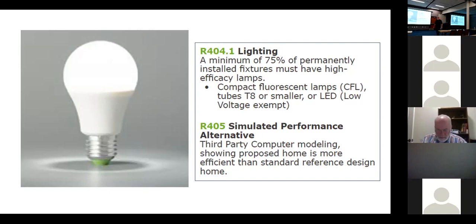I see the T8s up there. We've begun, 5 years ago, moving away from T8s completely off campus. And what we really like is you can take the drivers. Now, this is much more commercial than ever residential, but that's okay. You can put all the drivers in an accessible location because the drivers and things go first. So you can solve all those problems. Early on, I know we would spec that and you never got the right ones, and they wouldn't check them until they got these energy bills. It was like something's wrong here, and then they'd go back and find out all the tubes weren't the right tube.